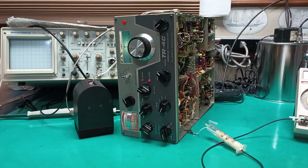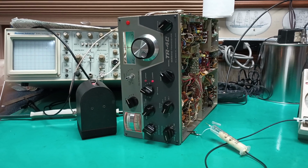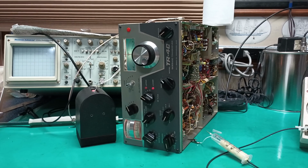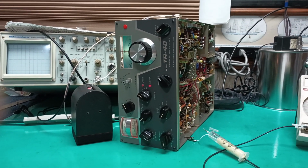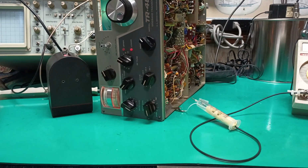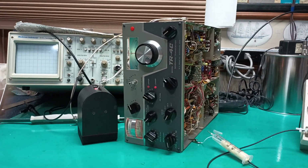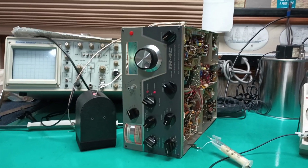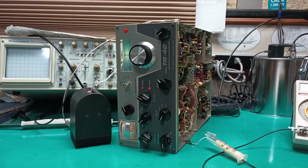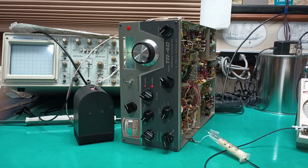About the only options are to get an external clock generator or an external source and build a small amplifier. You can also buy amplifiers. It's not rocket science, but it starts getting messy. Starts taking up space. Got to patch in a BNC jack down there, bring it through the bottom of the chassis, yada, yada, yada. It's not pretty. It's to get one band, 10 meters. I ain't real excited about 10. It's okay, but the rig will work on 10 if it has a crystal. So it works fine on everything else.